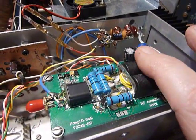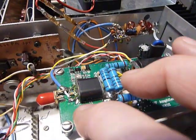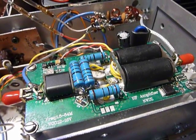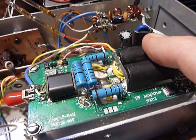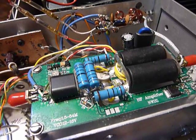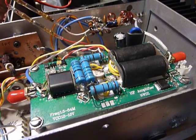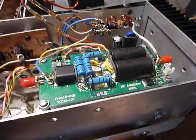I think I paid a little too much — $75 — for what I got out of that eBay amplifier. I did not like the MRF 9120 dual FET because of the way it popped right out at 2:1 SWR. I checked the SWR capability on the MRF 150s and they're rated at 30:1 SWR at full output — that's 300 watts out into a 30:1 SWR — so they really take a big mismatch.